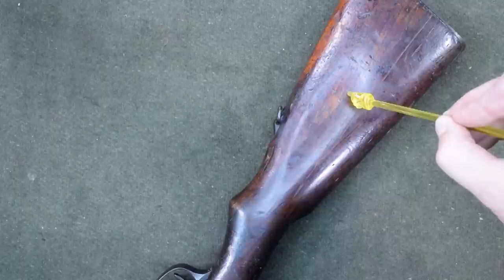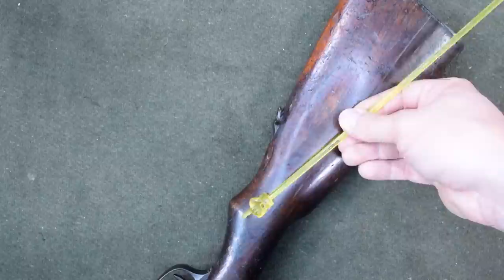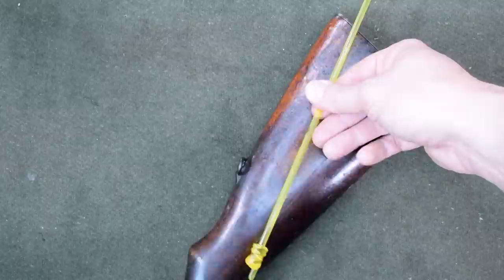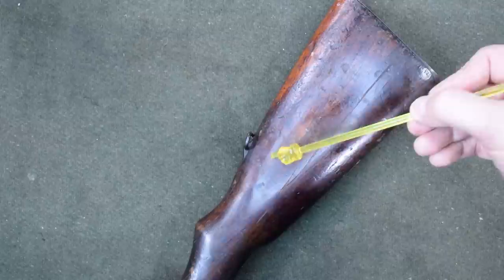It's right there. What happens is the grain for this stock, the upper section of the stock, is running this way. However, that was causing chipping at the toe, which still seems to have happened in the case of this gun anyway. So what they did is they wanted to have a separate piece of wood that they could put in a separate grain direction. This also has the added advantage of allowing you to cut a stock out of a smaller blank piece of wood to begin with and use up smaller pieces to finish up your guns. So they dovetailed it in, hammered it in from the rear, and then they set it in several ways.